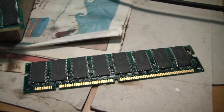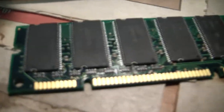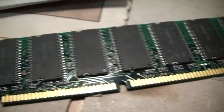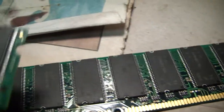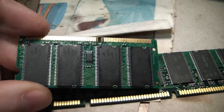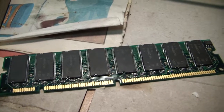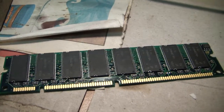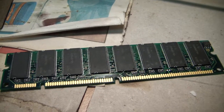I should have read the manual to see if the motherboard will recognize a 512 megabyte stick, and I also don't know if the resistors used on the SDRAM PC memory stick will allow it to recognize the correct capacity of the replacement chips. But I'm not going to lose much — these are old memory chips so it's worth a try. If I go from 64 megabytes to 512 megabytes, that would be quite desirable because that Linux Debian PC server is pretty starved on memory and that's causing me some problems.